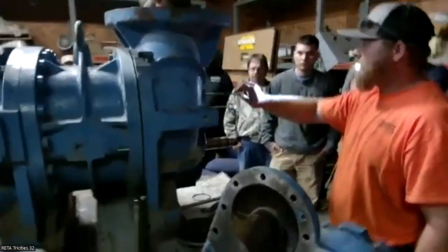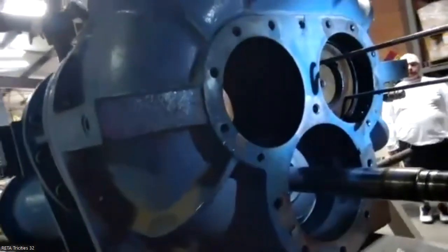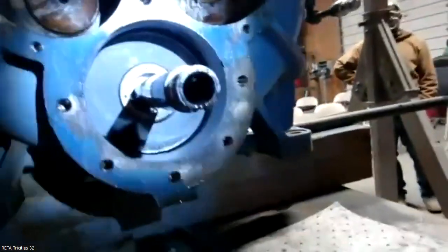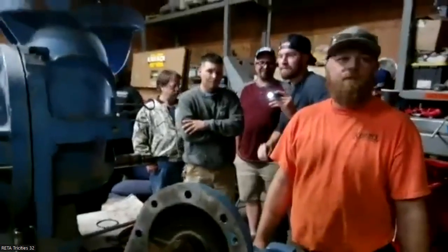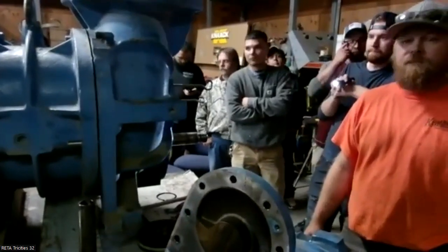You guys got any questions right now? So how much liquid does it take to really wipe them down? It doesn't necessarily take a lot. So when you say not a lot, does that mean it could be starved, not running the appropriate oil pressure, strainer got plugged, stuff like that, and so definitely prematurely? Any combination of upsets in the system related to oil, you know, pressure problems, just exacerbates it. Yeah.